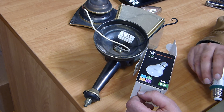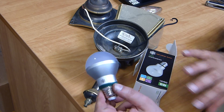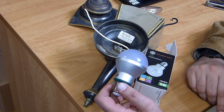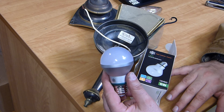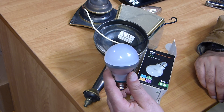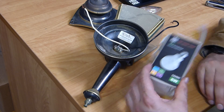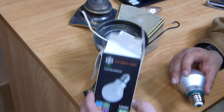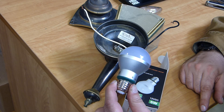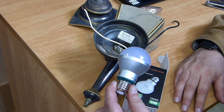Here they say this is a 6-watt bulb, which means it uses 6 watts of power. As far as the lumens or light output, I've tried to get the camera to get a good reading on this, and it's gotten a little tricky with this camera setup. I'll probably do another video in a few weeks once I get this installed at the cabin. But I wanted to show people what's going on and what some of the options are. If you want to use vintage light fixtures, chandeliers — all that kind of stuff that uses a normal screw-in bulb — there's an option. Not very many options, but if you want to do that on an off-grid 12-volt application, you can. It's using these Netmeter Solar bulbs. You're going to see these in future videos and wonder how I'm getting a conventional AC light fixture or chandelier to work in a 12-volt off-grid environment. This is how it's done.